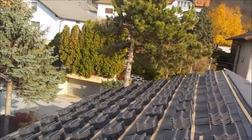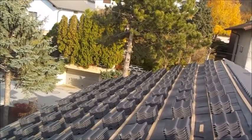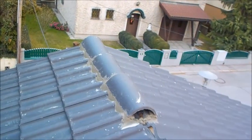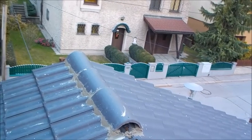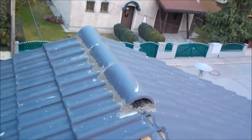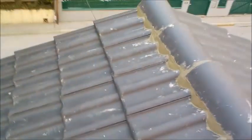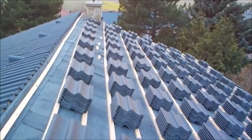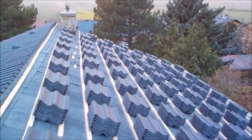What I'm going to do now is I'm going to get some cement mix. I'm going to get that gable end up. So I've started getting the ridge on, and you can see the cement starting to sag. There, look, there and there, and I've waited an hour or so to go off a bit so I can point it up, and I've got to do down that gable as well now. And then tomorrow, I've actually tiled that in backwards. Well, I did want to work tomorrow, it's Sunday tomorrow, but everybody moans if you work.